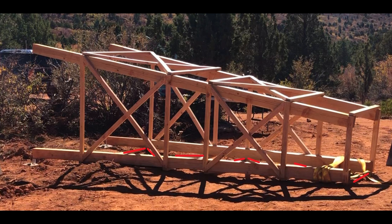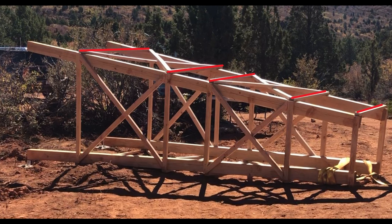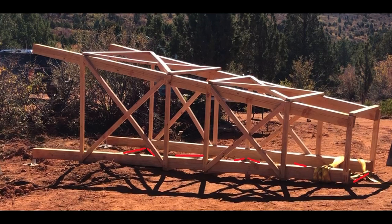So once again, you do the two pieces with the beams by themselves separately, and then you stand those two pieces up on each other's side vertically, close enough together where you can start nailing the horizontal pieces on, and then the cross members, and that joins those two pieces that you made. Once you get that nailed on, you need a couple of people to help rotate it so it doesn't break apart. You flip that on its back where you expose the last side that's not been done. Do the horizontal pieces on that and do the cross members. And then you have your tower complete.